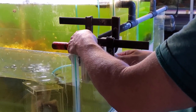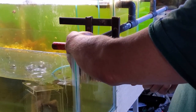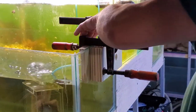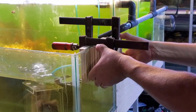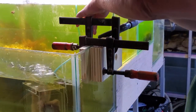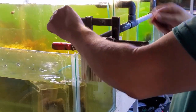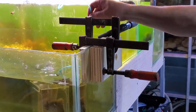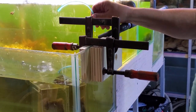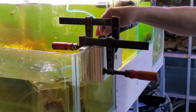This one here is two inches to any given edge. If I remember correctly from when I used to order glass, the rule of thumb the factory uses for drilling is about one and a half times the diameter of the drill hole you're making. But that is also because a lot of the stuff I ordered was tempered, and they tend to lose material in the oven if there's not enough edge to it.